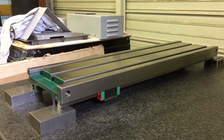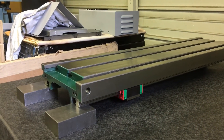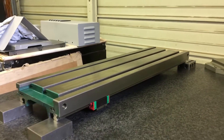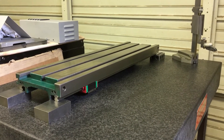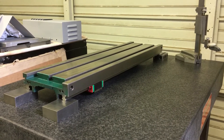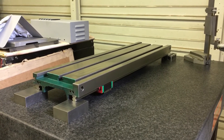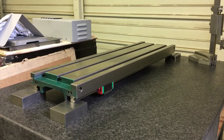It's not held down with anything. They just take 1-2-3 blocks or 2-4-6 blocks and crowd either end of the table. Because if you were to put the whole table onto the chuck and turn it on — it's a ginormous magnet — you want to grind the table flat to itself, flat to the points, and not pull any distortion into the table. So I think that's how it worked. It could be completely out to lunch, but we're going to go with it until I need to eat crow.